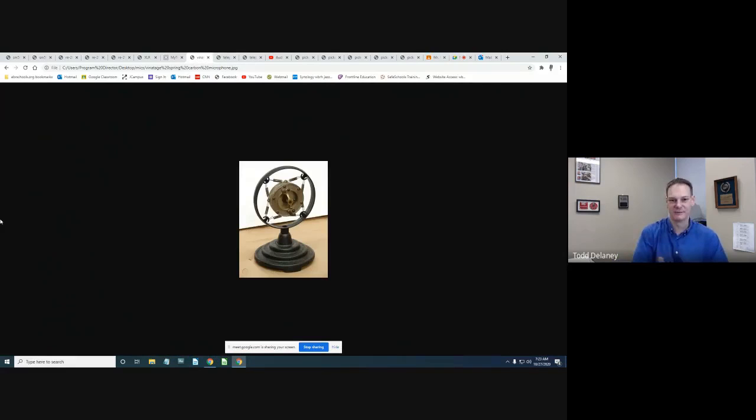Let's get into the different types of microphones that you may find or you may see. This is a carbon microphone, and we're going to build one of these probably in the next class or two. This is an old microphone, super duper old technology. It's got some carbon granules in it. Well, what are carbon granules? Take carbon, like charcoal, and crush it up, and you throw it in there between two plates, or basically two pieces of aluminum foil. Or you can do a couple of different ways, but basically you have a diaphragm, you have a fixed plate, and you throw carbon granules between it. And then you speak into that diaphragm.